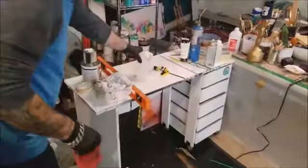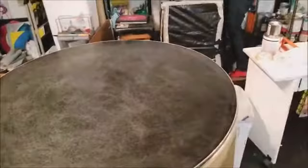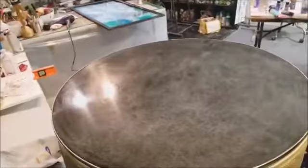So after you sand it down, wipe it off with 91% isopropyl alcohol. You can just get it at CVS, like $4 for a bottle, or you can buy it in bulk. It doesn't take much. You just wanna make sure you get the dust off as well as any sticky stuff that may have been on there. When you sand and when you use alcohol, wear gloves, because the sandpaper will eat your fingertips up. I learned that the hard way the other day. And the alcohol will dry your skin out lots.